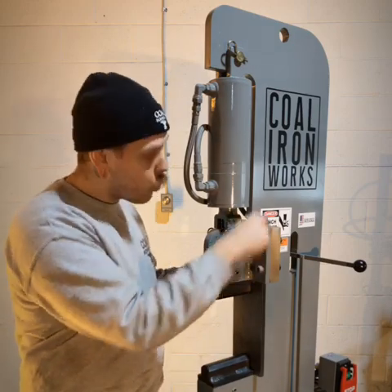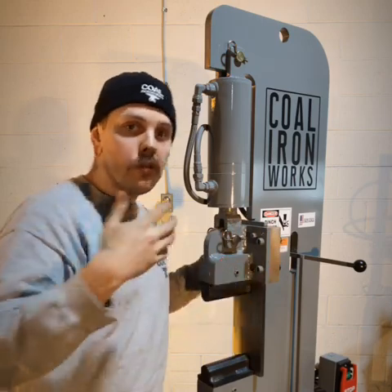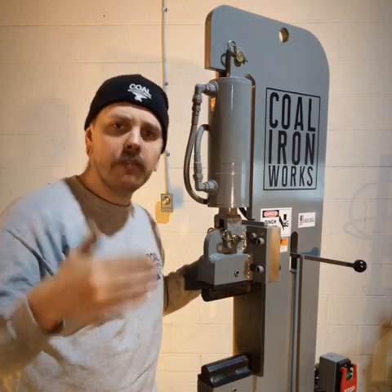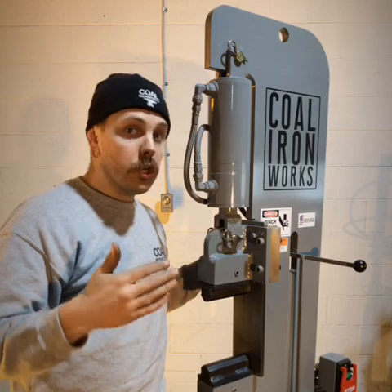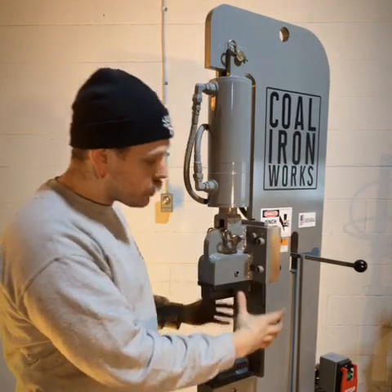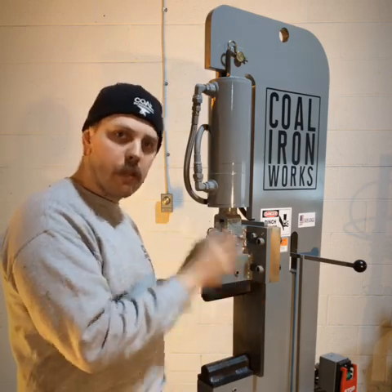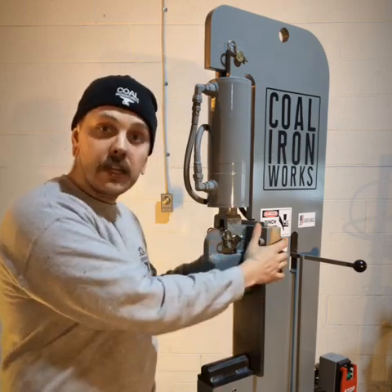If you're starting to get loose bolts or wear into these guides, you'll notice things get a little looser. You can overcome that by checking the torque. You want a minimum of 80 foot-pounds applied to these four outer screws and up to about 110 foot-pounds. You're not going to go to 110 right away — you need to leave yourself a little room so you're not clamping the bronze so tightly that you can't move the slide at all. If that happens while torquing, let them all out a little, relieve that, then start again getting to 80 and working your way up.